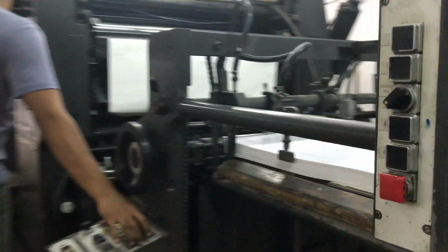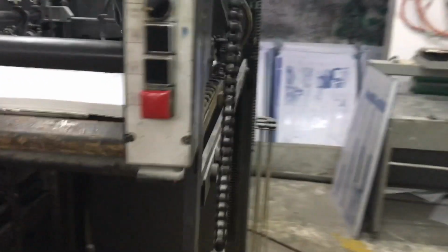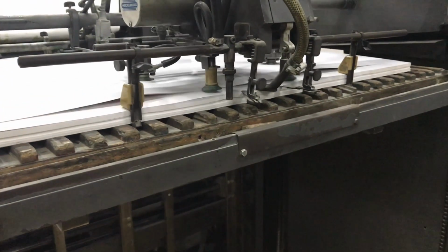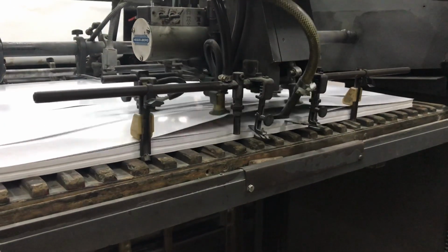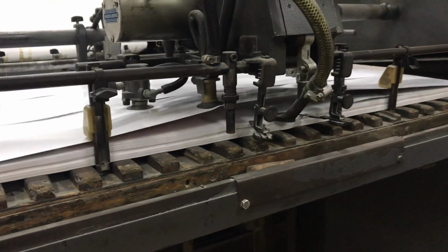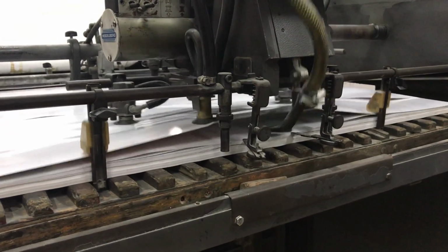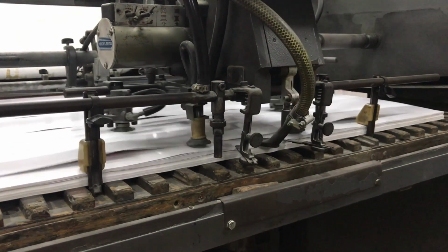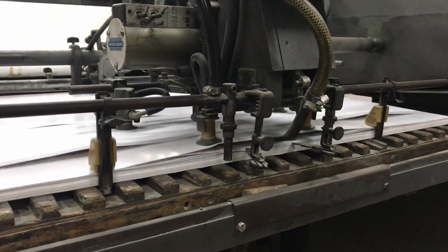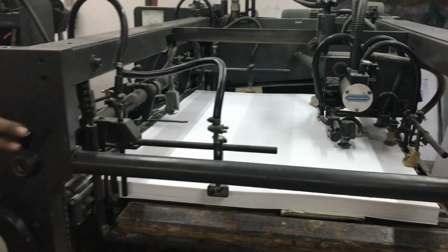So they've already turned on the machine, and this is the feed. This is where all of the paper goes in, and I just wanted to show you this thing again right here. It is constructed of a series of tubes and metal spikes, and two of the ends have suction cups on them that the paper sticks to, so the suction lifts the paper up, and then a separator sort of encourages the separation of the sheets before another moving part with suction cups on them propels the sheets forward.